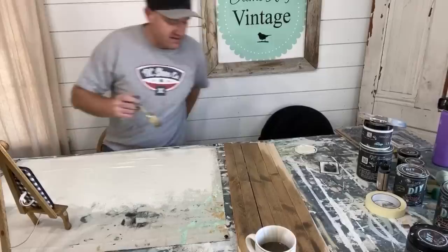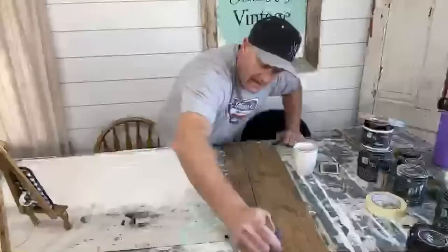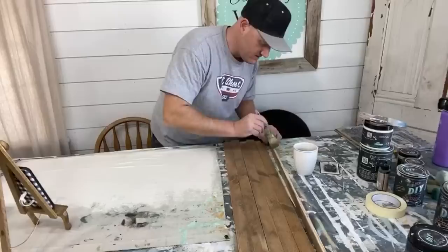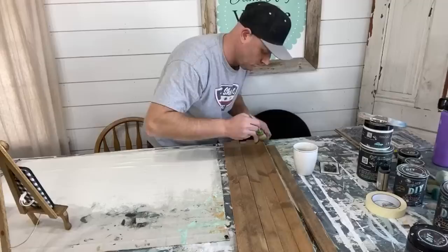You can see I've got a light color on this wood — when it dries it'll be even lighter and I might wipe some of it back. It won't have the sealing properties that Dark and Decrepit usually has once you've added that much water to it, so you'll still need to seal this. But it's a real easy way to make up a quick stain — I don't have an exact formula, I just add until it's the color I like.